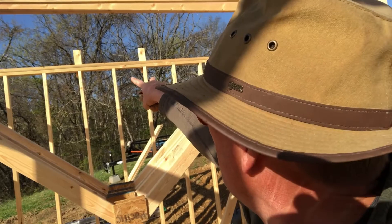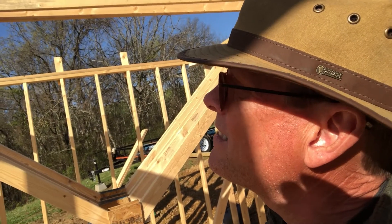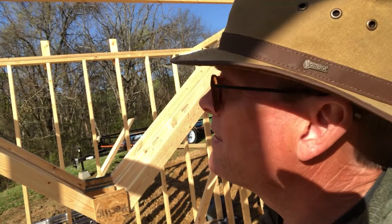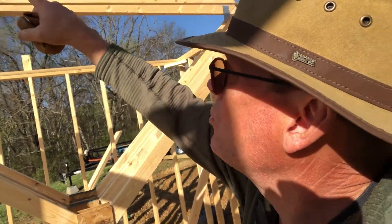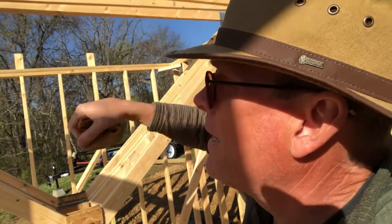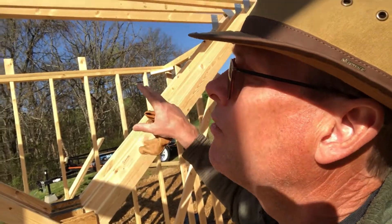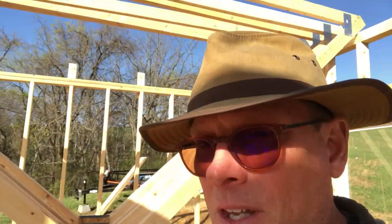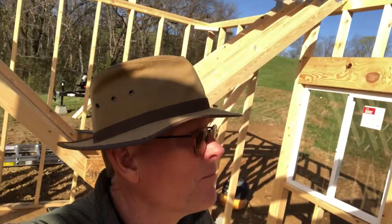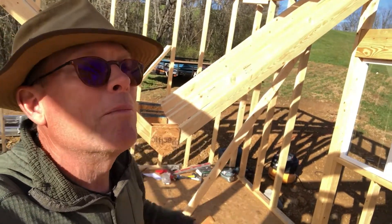This is a work in progress. I've just got those two boards up because I'm putting these on by myself — I've got them hanging like this, then I'm going to tilt them up. I've got hurricane ties for a couple of reasons: one for the wind, and second it'll make it easier to tie the trusses into the walls. Once I tilt it up I'll have a good anchor point to efficiently tie the trusses to each other and to the walls. Then I've got boards on two-foot spacing, and I'll use the boards in between to lock them together.